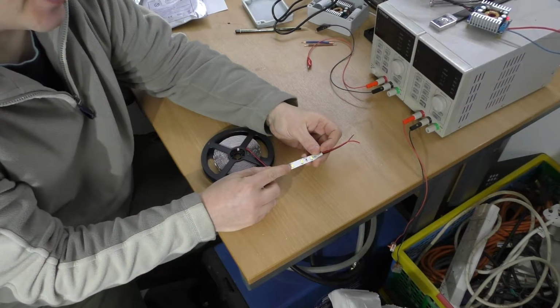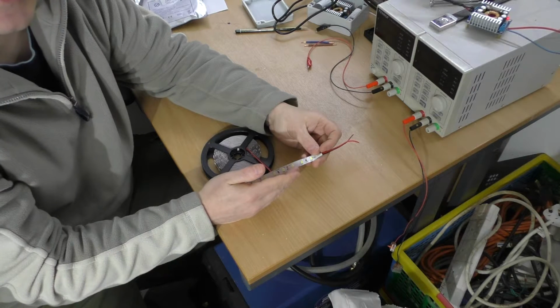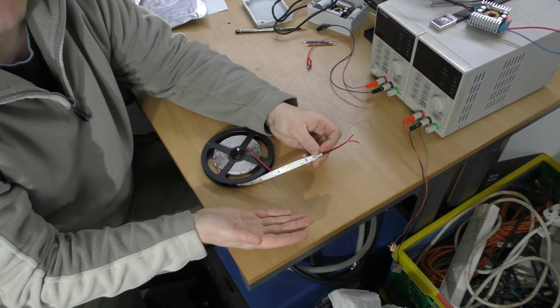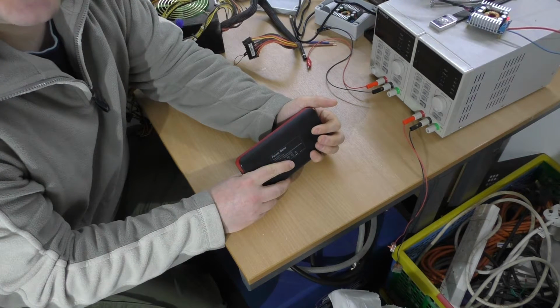When you drive an LED, you should do so from a constant current source, but because the ribbon comes with resistors built in, we can use a much easier to get hold of constant voltage source, and you can pick up 12 volt sources from just about anywhere. Powering LED ribbon is as simple as providing 12 volts. You can get 12 volts from any number of sources.